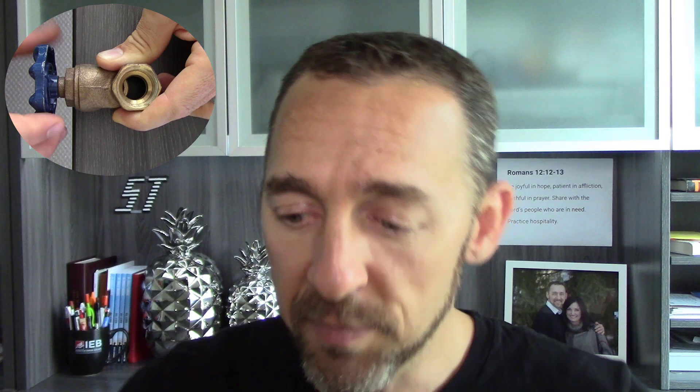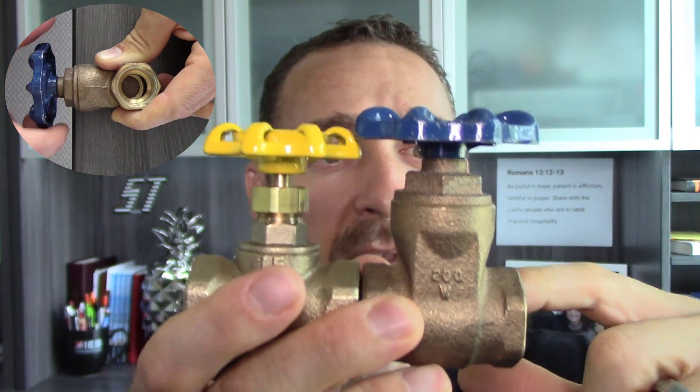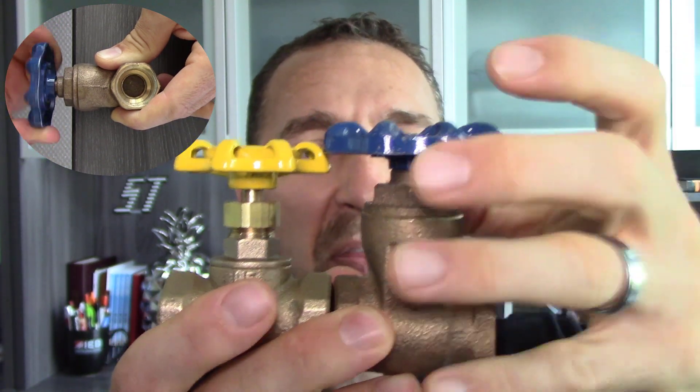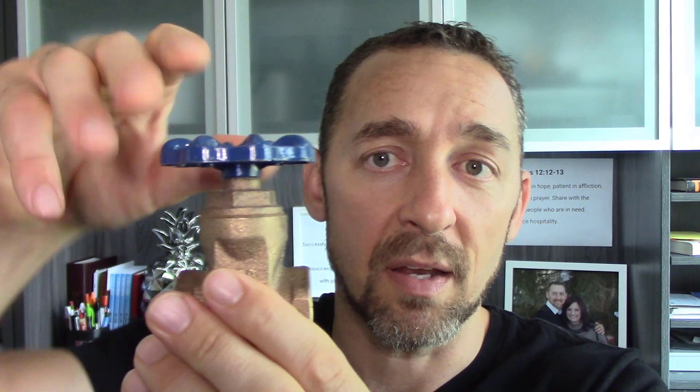Next, we've got a gate valve. Gate valves are also only used for water. To tell whether these are open or shut, you're out of luck — you can't do it by looking at it. The way these work is when you turn this handle, you're actually moving a gate up inside here. If we contrast the two, on a gate valve you've got this big, thick housing for a gate to slide up inside of. On a stop valve, not so. There's no stem showing on a gate valve — it's right next to the handle — so we can't tell whether these are open or shut by looking at them.